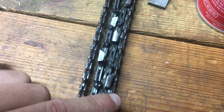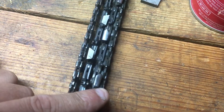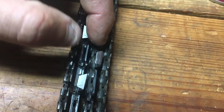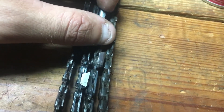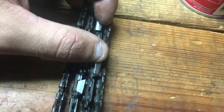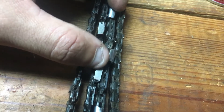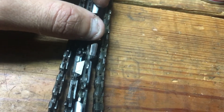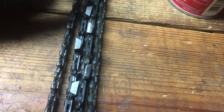What I have here is a big 404 chipper chain. Chipper chains are completely on the opposite side of the spectrum from chisel chains because the chipper chain has a really shallow grind angle of around 20 to 25 degrees. That gives it a much blunter edge — it's sharp because it cuts wood, but not nearly as sharp, so it doesn't cut as fast. The advantage is you don't have to sharpen these as much because the blunter edge stays sharper longer than the almost razor sharp edges on chisel chains.